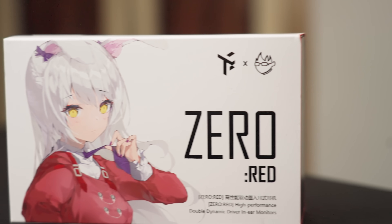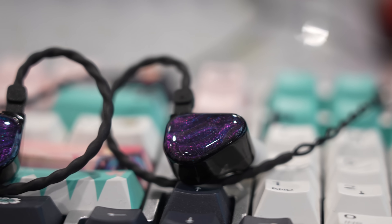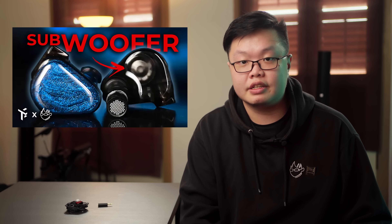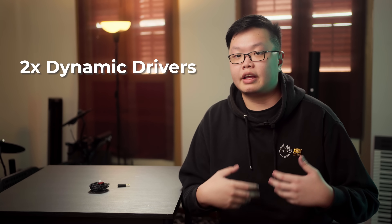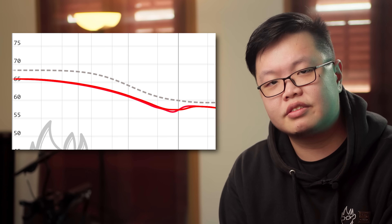Now that's just the simple quick lay-down, but there is still so much more I'd like to explain. Before I go deeper into the Red, I first have to talk about the original Zero and subsequently the Harman in-ear target. Let me go into the nerd shed. The original Zero was created for two big reasons: first, the subwoofer multi-DD concept — I wanted it a reality and it finally was. The second was filling a hole in the sub-$100 market with a Harman tuning. The Red, just like the original, has two dynamic drivers, one of which is crossed over like a subwoofer at roughly 160 to about 180 Hz, creating that really nice 200 Hz bass rise.